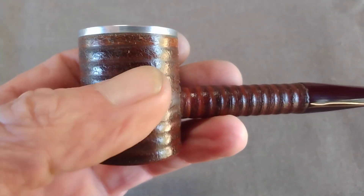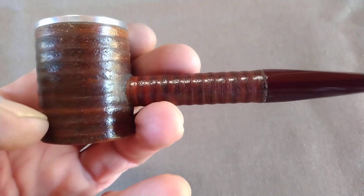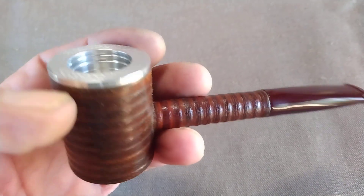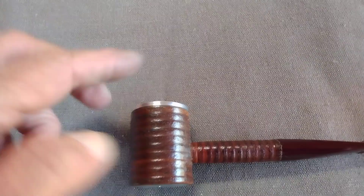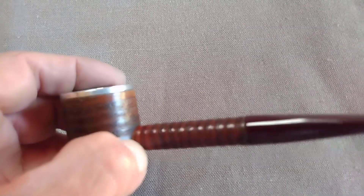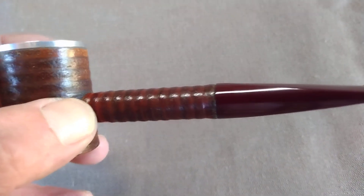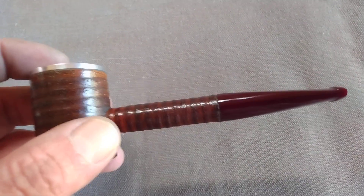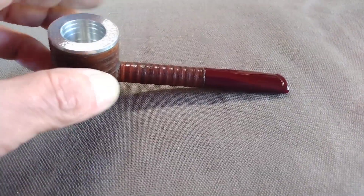This just came off the buff. The leather was stabilized first, then epoxied and machined to fit over the core. The core is actually shaped like a T, and this is stacked up against a countersunk quarter-inch stainless steel tube. Stacked leather again — getting the leather that thin wasn't easy.